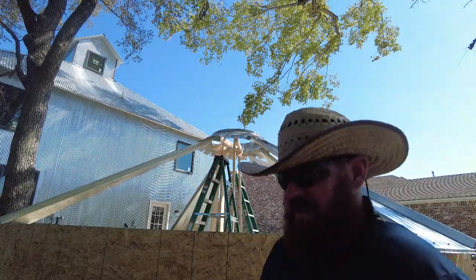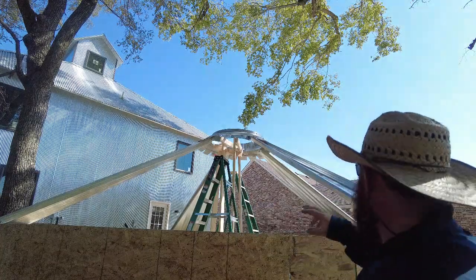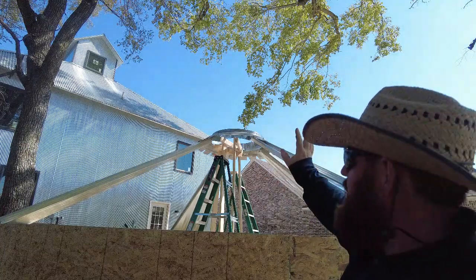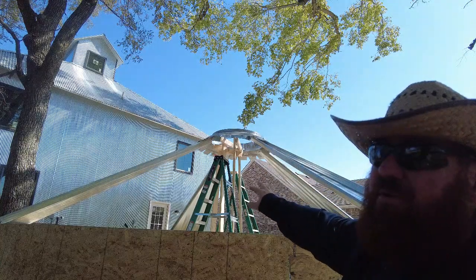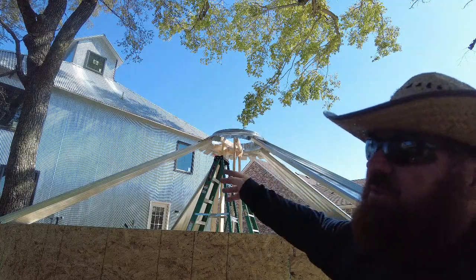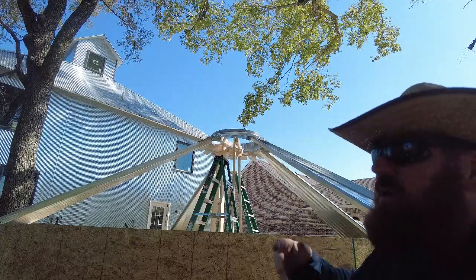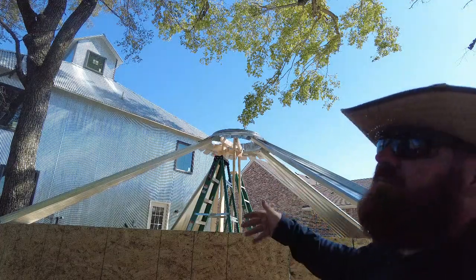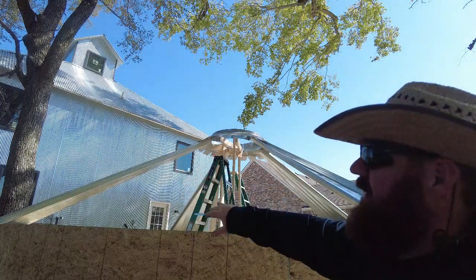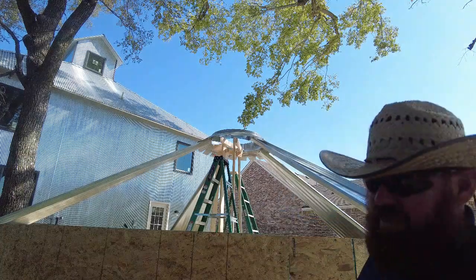So, all right. Well, I'm gonna start decking this. What I'm gonna do is screw this to the wall here, and then I'm gonna start not on these panels that are screwed because there are supports holding the thing up. Instead, I'm gonna start next to it, and then as I come to a panel that's screwed down, I'm gonna take that panel off, install the panel, and then keep moving. I'm not going to work with the panels that are here because I don't know if they're perfectly round or not. So we don't want to do that. All right, let's get to it.